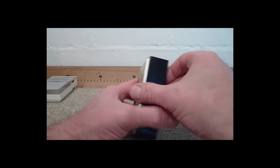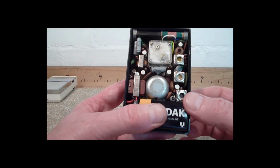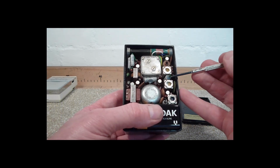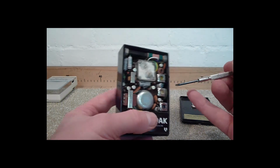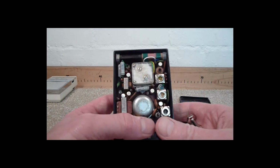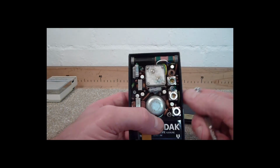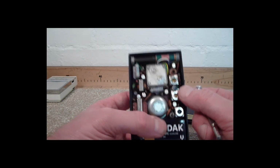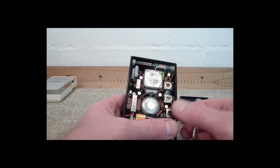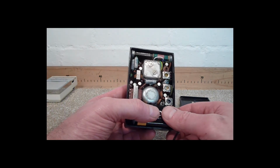Let's turn him off. If you look at the back, and this is going to be a bit difficult to see on the camera, but can you see the capacitors here? There's the top of one, got a couple there. The tops themselves are bulging, which means these capacitors have really had their day. So it'd be interesting, what I might do is replace the capacitors on these and see if we can get this whole girl working. Might make a video of that, and if you'd like me to do that, by all means give me feedback and I'll see what we can do.